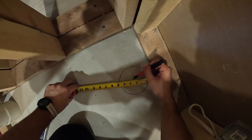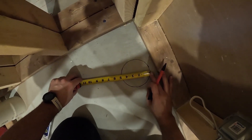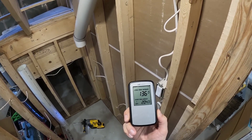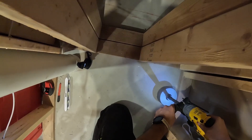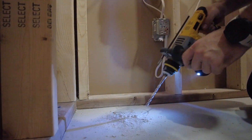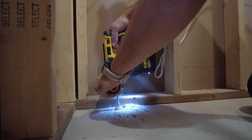The fan is in the attic — we don't hear it much and it works very well. Everything's been glued with PVC glue for a nice tight seal. There's a manometer you install once you're done; it's like a suction gauge. Anything other than zero means there is suction in the tube. I had no easily accessible vertical pipe sections, so I drilled a hole into the pipe through the drywall and inserted the manometer tube there to check for suction. If there is suction it pulls on the fluid, and anything other than zero shows a vacuum, meaning the system is working.